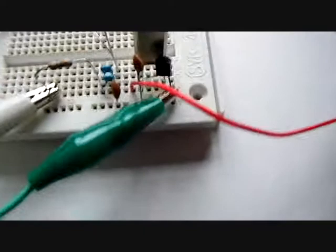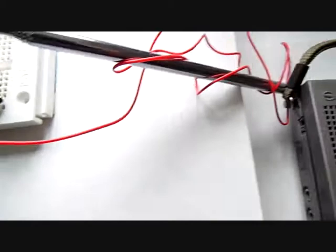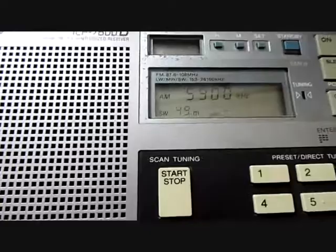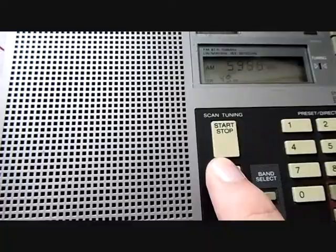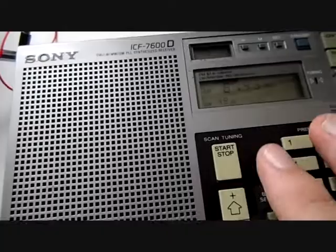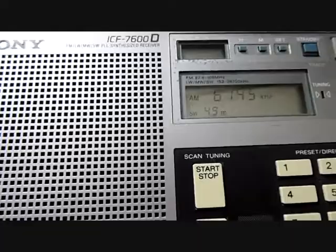Now I want to test the transmitter. I have connected the audio source — one lead goes to the transistor, the other goes to the resistor, and the leads go to this connector. My MP3 player is waiting. My 9V battery is connected, as is my radio. I have wrapped the antenna wire from the transmitter around the antenna from the radio, since I designed this transmitter to be very weak and therefore legal. I am in the 49 meter band. I will search the station on the radio. The crystal is marked 6.144 — we can neglect the one kilohertz. The radio is now tuned to my station. I turn on the MP3 player and we hear music. As you can see, it works just fine.